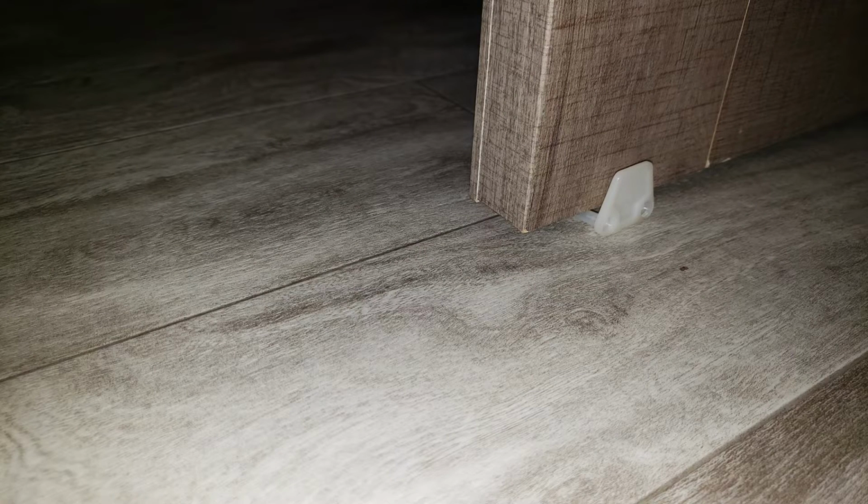Well, the problem is simple. The door rubs on the plastic keeper, which is mounted to the wall at floor level. This guide does have value. It keeps the door from swinging side to side, but the bottom of the guide is just too thick. It was high. It rubbed on the bottom of the door. So I decided to discard it completely and replace it with guides that have no bottom section at all.